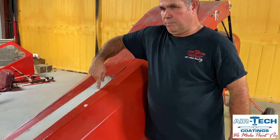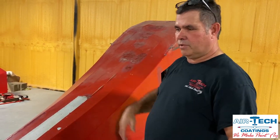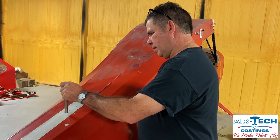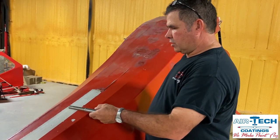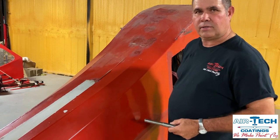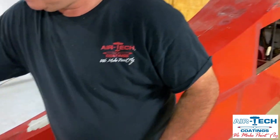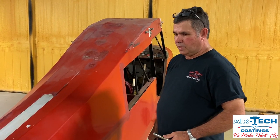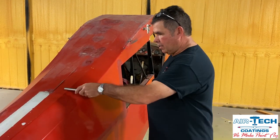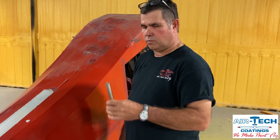I don't care if you can poke that at 300 pounds — this airplane needs to be recovered and looked at inside. So it did its job, it's time to recover. But if you're using one of these tools, and that airplane has been covered right with proper UV protection — tongue in cheek, it is kind of like a lifetime — it's a lifetime of whatever that airframe is going to be. I just thought this was a good example to poke around on an airplane that nobody's going to fight me about since they're fixing to tear it down, just to show you when people talk about different test methods. To be honest, until I owned Airtec about three years ago, I never fooled with one of these. My test was: your fabric feels fine, I see no problems, let's look at the books and go with that. But guys will poke around on something, find something that sounds like a failure, and think the fabric's no good. So this is just something I wanted to show — for what it's worth — when people talk about a punch test, what they look like and everything. Thank you.